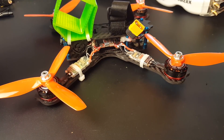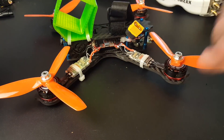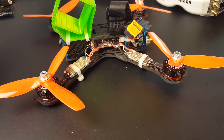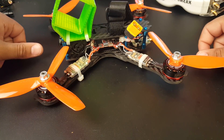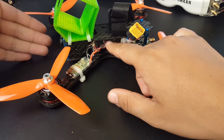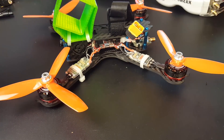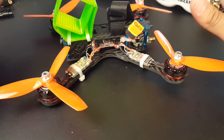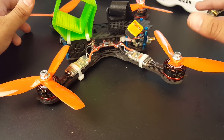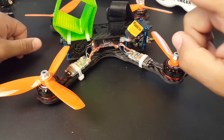Anyone who has them, please let us know how your experience went, because overall — heat sink, LED (who cares about the LED), current sensing, we have telemetry — they run clean and they're pretty cheap, like 15 bucks each, probably four for 60 bucks or maybe even less. Not a single problem. I built it, put it on the ground, and flew it. All I did was change the rates and fix the board orientation to 90 degrees, because the board comes mounted at a weird angle. After doing that for the flight controller, I just put it on the floor and went flying — didn't have to do anything else. Just plug in the battery and go fly. It flew, and I really loved it. Pretty efficient, pretty clean, no weird anything. I'm very satisfied with both the flight controller and the ESCs.